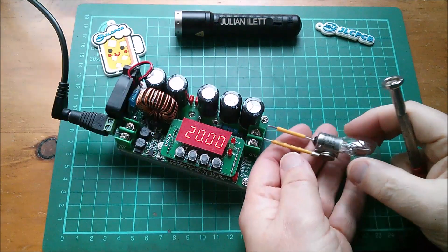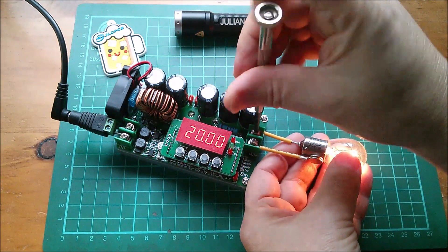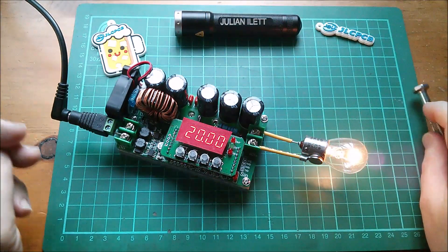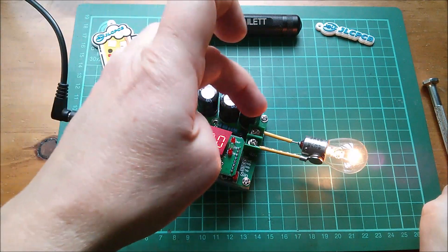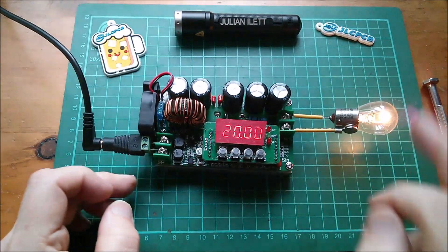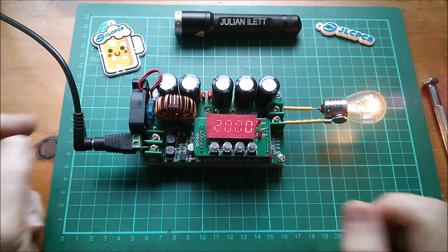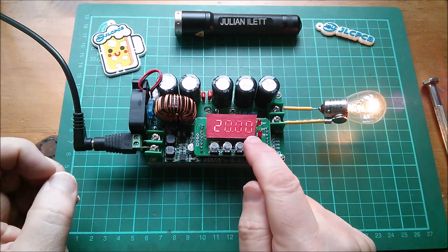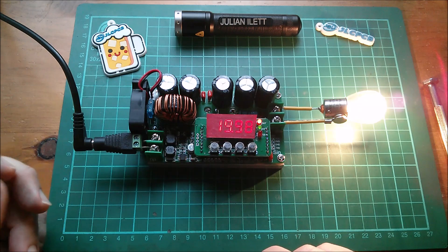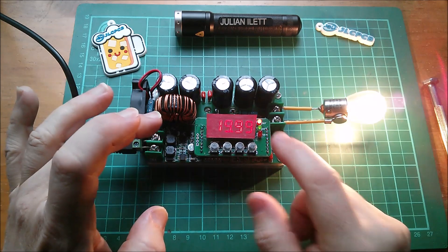At default settings that will work nicely with a 24-volt bulb. Now you've got to remember that even when these boost converters are off, they're on — because the primitive boost converter topology, which is inductor-diode straight to the output, can't actually shut the output off from the input. So what we're getting into the bulb is just what I'm putting in, about 11.7 volts. If I turn this on, we should now get boosting up to 20 volts — which we do.